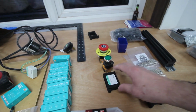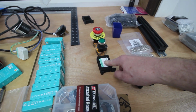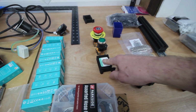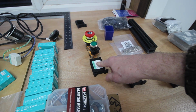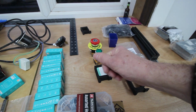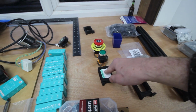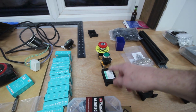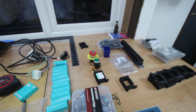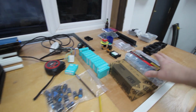It's also going via one of these, so that if you get a problem, and I do this because I have had a problem in the past, my table saw, you probably can't see that, but my thumb's a little bit of a funny shape because my table saw put me in hospital. I had a piece of wood kick back. I ran indoors with blood pouring out of my thumb and was unable to turn anything off. But with this, you can, in theory, shout, "Hey, Siri, Google, whatever, turn the workshop power off." This will then turn the power off via the contactor to the whole workshop, which I think is a safe way to do it. I've got floodlight.